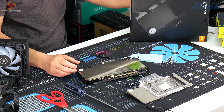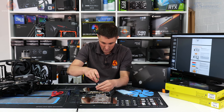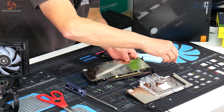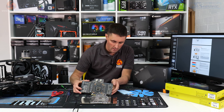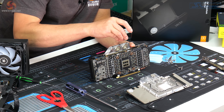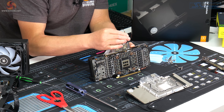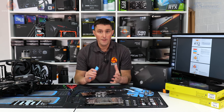To begin the installation, if you've already got your card assembled, you'll need to remove the standard backplate — just remove the screws. If you're installing the backplate at the same time as installing the block, once you've got the water block attached to the card, you'll need to remove the terminal from the top. Just completely loosen off the three screws and that terminal removes from the card.